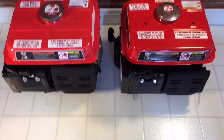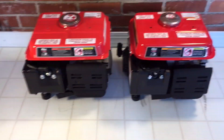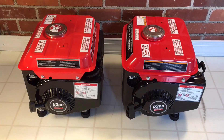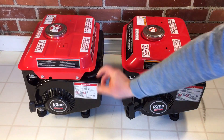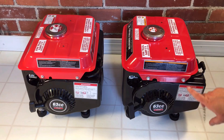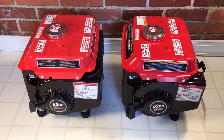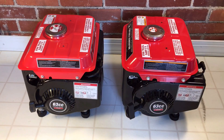That's just a visual comparison right out of the box. Looking at the back one more time, the insulation on the coil wire is very evident on the newer 69381 — the older 60338 has no insulation. The side covers look identical and I don't see any difference in those. Sticker placement is a little off on the older one but almost perfectly centered on the newer one.